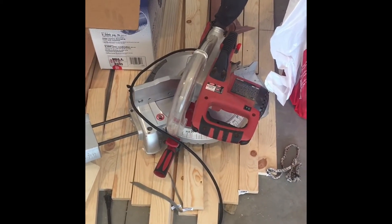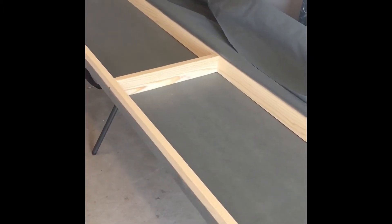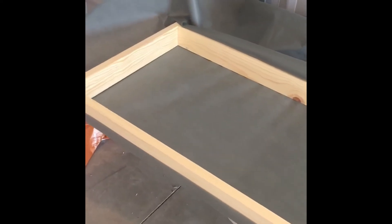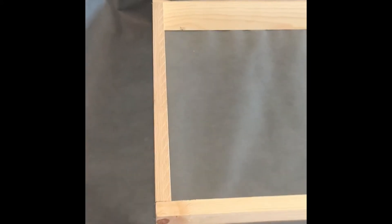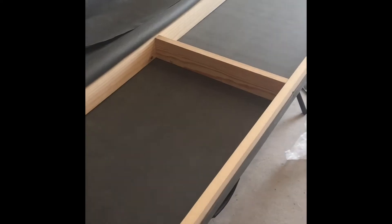You can do it with hand tools if you really had to — it would suck, but you could do it. Here we have a frame. I just went to Home Depot and got some sheet — I think they call it white pine or something. I basically made them without even having to cut the long pieces. I bought 8-footers and you cut the cross pieces at 15 inches, and put the center piece at 47 inches.